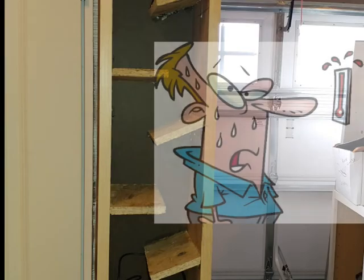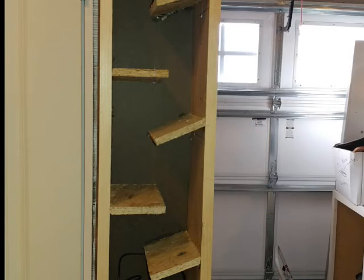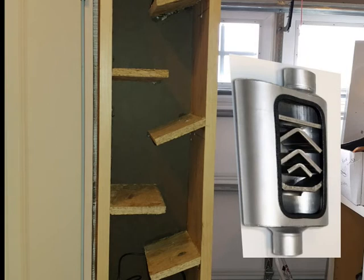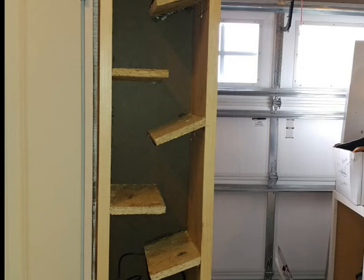If you've ever worked in a booth, fresh air gets real slim after a while, so I wanted to provide some ventilation. I originally called this my cooling tower, but it doesn't really cool — it does keep me from suffocating in the booth with a nice flow of fresh air. But openings to the outside have to muffle any sound — you want airflow but no sound flow. Look at these baffles — it's kind of like what you would see inside a car muffler. Sound moves basically in straight lines, so any sound that comes in hits an angle, then a flat, an angle, a flat, and it keeps the sound from propagating into the room. All those baffles are covered in fiberglass. Even this little ventilation tower — boy, that fiberglass was stabbing me in the hands and wrists for days.